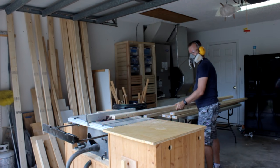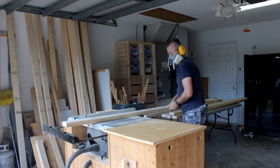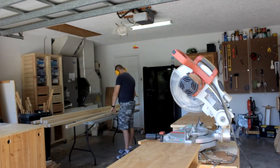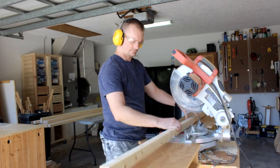Let's build a chicken coop and have a little family time while we're at it. I'm going to start with the framing. I took some 2x4s and ripped them down to 2x2s. You can skip this step and just buy some 2x2s if you wanted. Then I'll cut all the pieces to length.